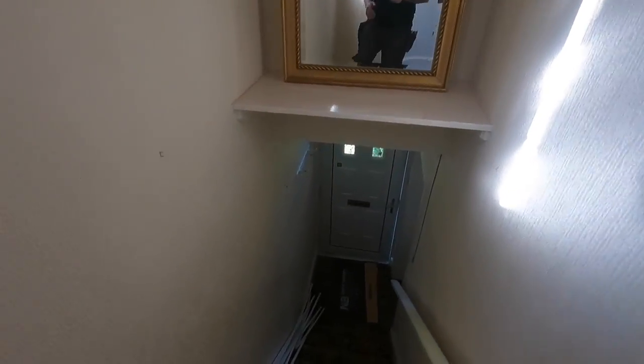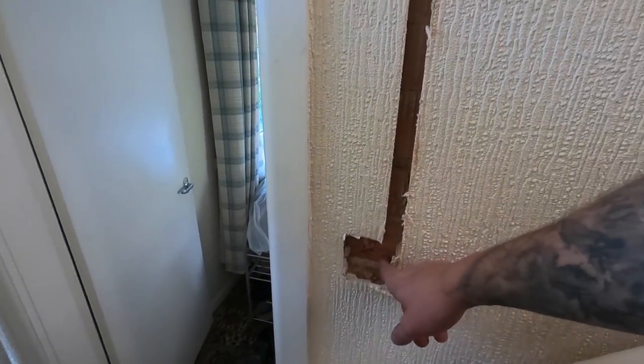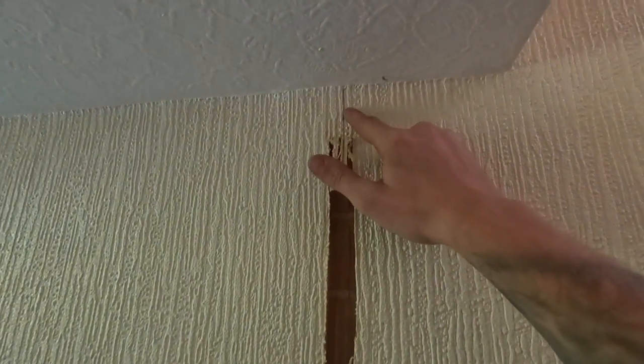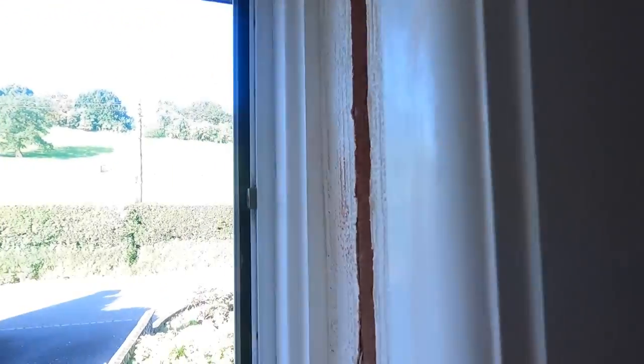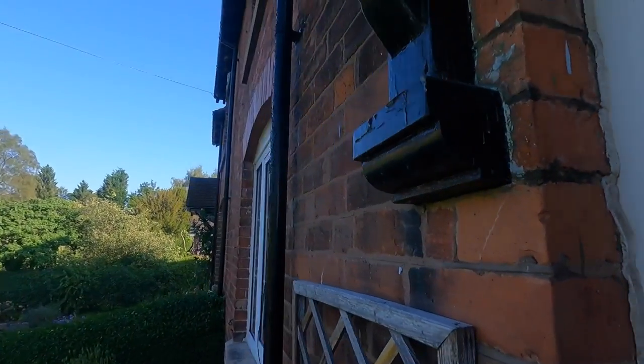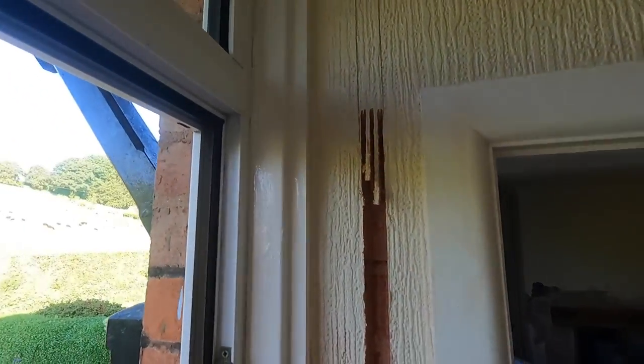I've got a few extra light switches to sink in here. I'll use the old one here - I'm going to sink it a bit further for a 25mm chase. A little bit more up - that's about as high as we can get our chases. And sink this one a little bit more for the outside light, then get a good angle off the drill bit, which you'll see me do very shortly. I need to get an outside light feed here, so we need a long drill bit straight through on the angle.